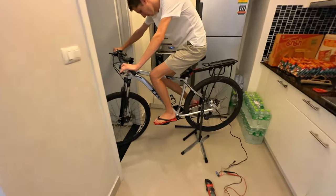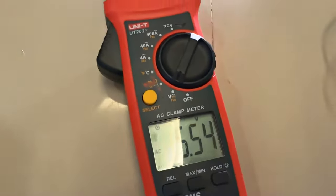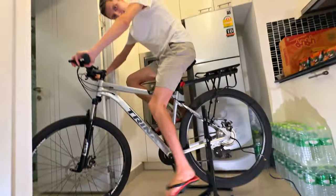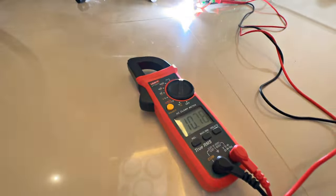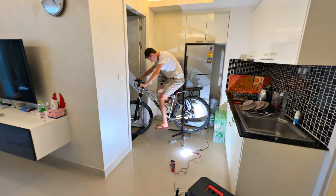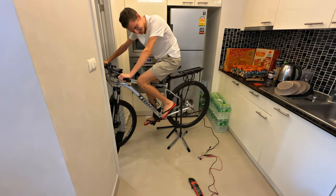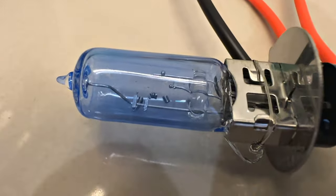Let's accelerate a little. One advantage is that you can switch speeds — by changing the sprockets, you can choose the optimal load so that it is easy to turn. The lamp lit up. We measured 6 volts at first, then 9, 10, and 12 volts — the lamp burns very brightly. At 12 volts there is about 100 watts. But then it burned out immediately — the spirals have melted. There is clearly more than 100 watts being generated.